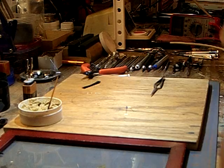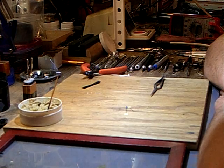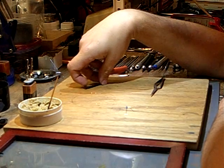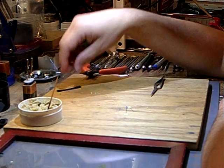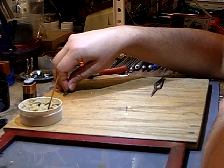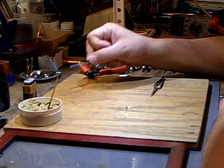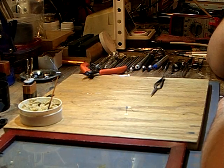This is an 0805. There are 0402s, which are the smallest. There's an 0603, which is about half a millimeter by one. The 0805 is about one and a half by two, and the 1206 is maybe two by three. There's specific information on all of the items we have for sale — I forget the exact sizes off the top of my head.